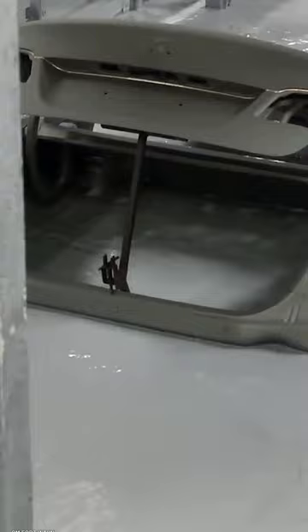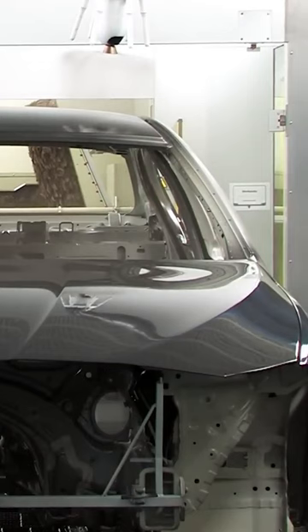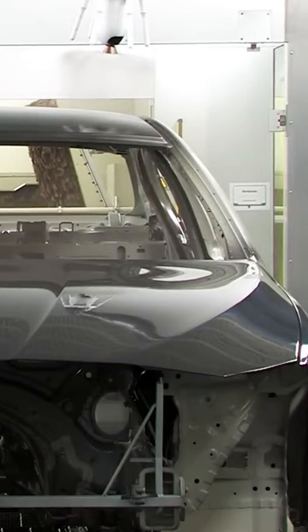One marker streak from a hand could mess up the finish. Basecoats and topcoats are applied with electrostatic spray guns. They spray positively charged paint particles which spread widely because too many positives repel. The paint particles are attracted to the car's negatively charged surface, resulting in an even coat.